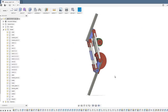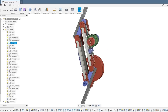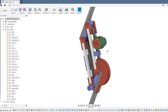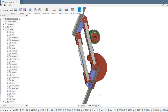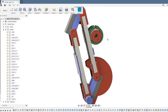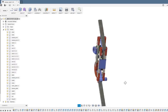We're going to make this basic leg design out of aluminum extrusion and 3D printed parts. The plan is we've got a parallel link so that we've only got really one motor. We haven't got separate hip and knee joints, which keeps everything in line with just one motor. We'll have a motor with a pulley at the back that pulls up a big pulley via a flexible tendon. We'll measure the position of the joints, work out the difference between where the motor should be and where the actual joint is, and calculate the force applied to the joint.